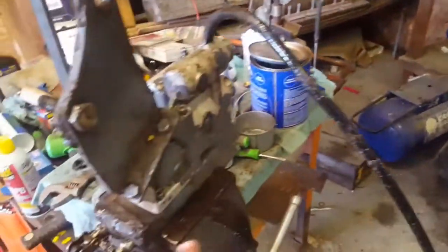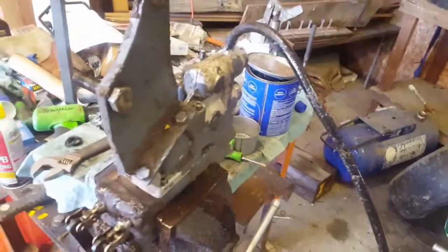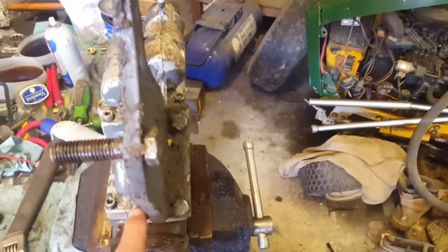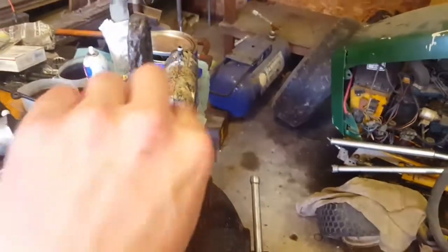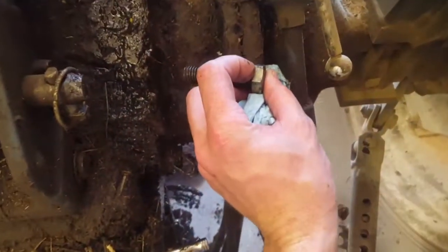The idea here is to spray and clean all this stuff up around here, because you don't want any little bit of grease to fall down inside. We're not using those nipples — the new ones don't have those nipples on there. We've got three bolts right here — looks like a 14 millimeter or 9/16 — one, two, three — that'll take this pedestal off of here. That's one of the big mounting bolts.